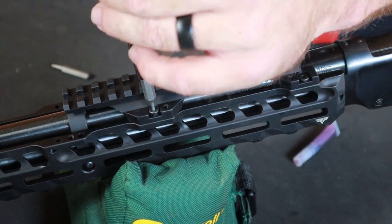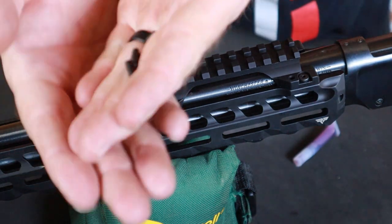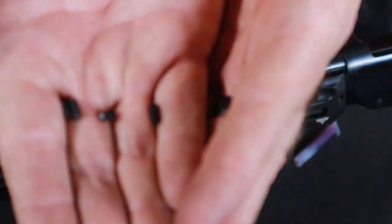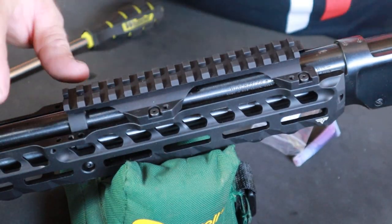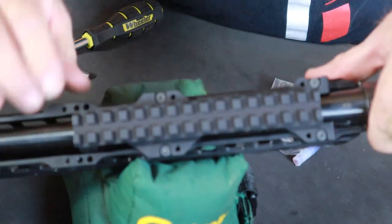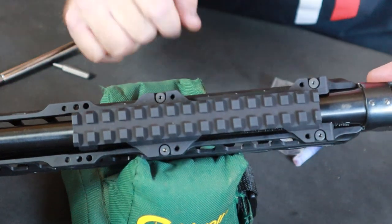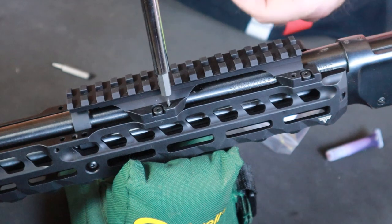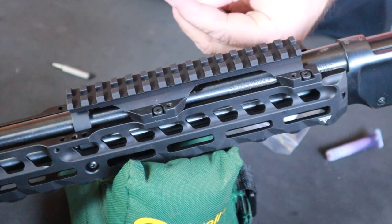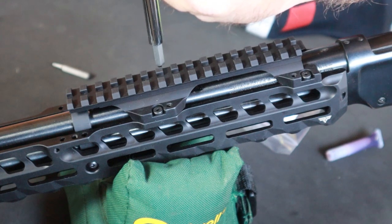Those four screws are holding the gator on. Now we need to look at our jack screws — these little allen set screws right here; they're like little ants. These jack screws go in the holes directly behind the rail. Roll this over and you see these four holes — those are for your jack screws. Be careful not to cross-thread; just run those down until they sit right on top of the rail. It doesn't take a ton of torque. The torque from your mounting screw and the torque from your jack screws will fight each other and keep this thing clamped down like a dadgum gator.